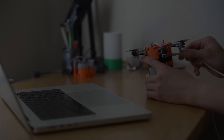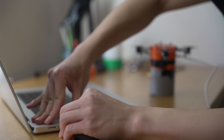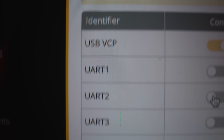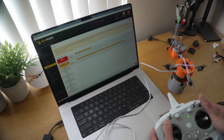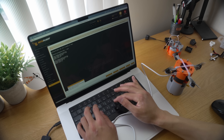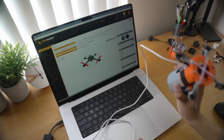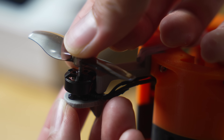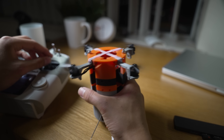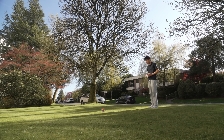We also couldn't get a compatible flight controller in time, so we are forced to manually control the CANSAT from the ground using Betaflight, which is meant for FPV drones. Here I am setting some basic settings needed for the drone to fly: the controller has to be set up to communicate, we need an arm switch as a safety switch, and there's a safety feature that prevents arming when moving too quickly or at an angle — but we need to bypass it so we can arm even when it's tumbling violently as it exits the rocket. Although my calculations say the motors provide enough thrust, I still doubt that these tiny propellers are all that's needed.